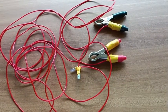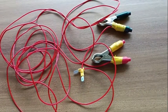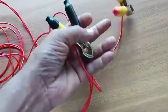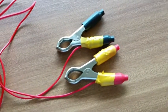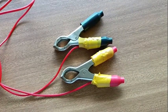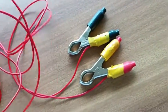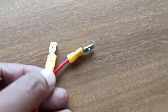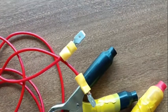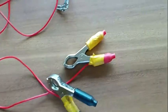To carry out this test, the first thing we require are two separate wires. As you can see in the video, I have taken two crocodile clips, which are available in the market. I have taken two wires — one end connected to a crocodile clip and the other end connected to a lug. Depending on the AVR model you have to select a particular lug. With two crocodile clips, two wires, and two lugs, you are ready to bypass the AVR.